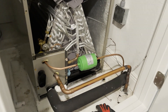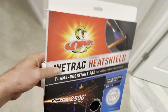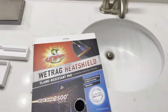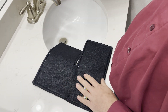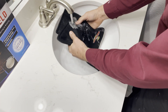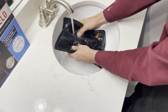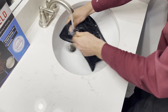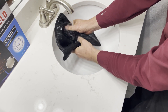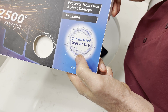So we're getting ready to braze here. We've got some stuff that would probably be good to keep flame off of. First things first, we're gonna pull this out and get it wet. Being able to get this pad soaking wet means it can absorb a lot more heat when we're protecting stuff — make it that much more flame resistant. It does say on here that you can use it wet or dry.